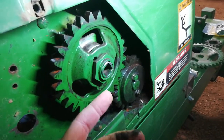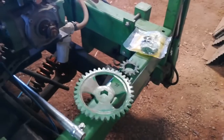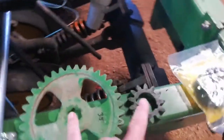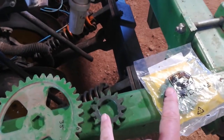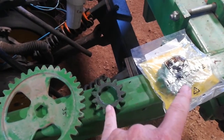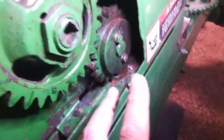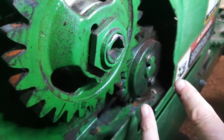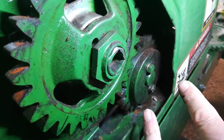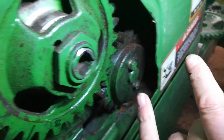This is all to say what the difficulty I faced when trying to switch gears right before planting the cover crop. I had no problems with the wheat using the normal size gearing, but when I wanted to use the smaller gears, not only did I have the wrong part, but putting it on and off was — I want to say a nightmare. You have to get new roll pins every time, you're pounding on it. There's got to be a better way, so I'm trying to come up with some kind of little press to press that roll pin out.